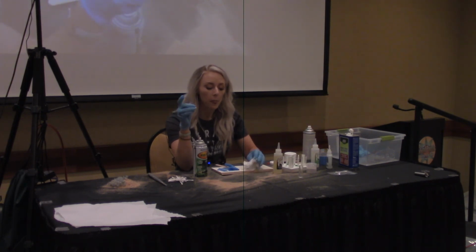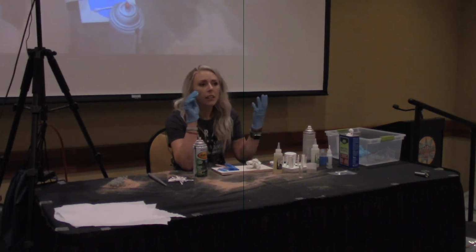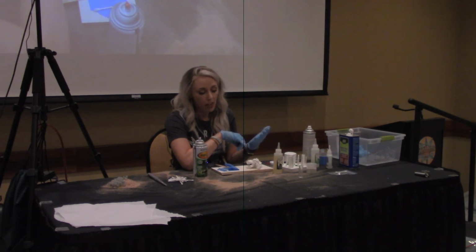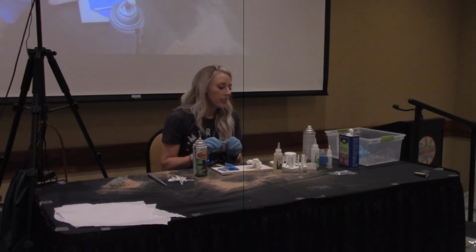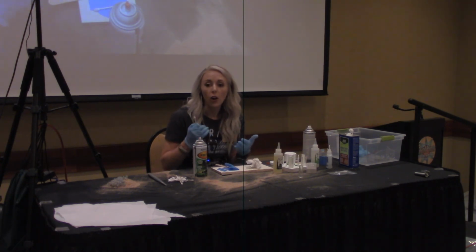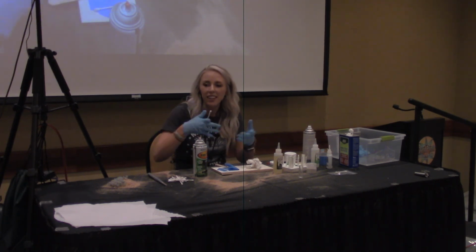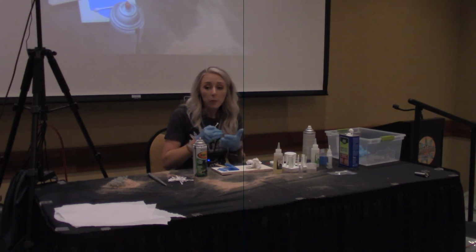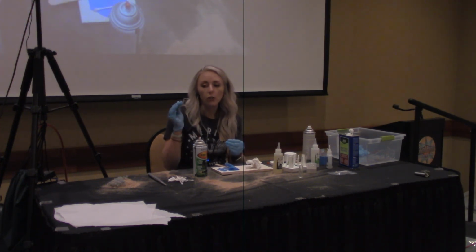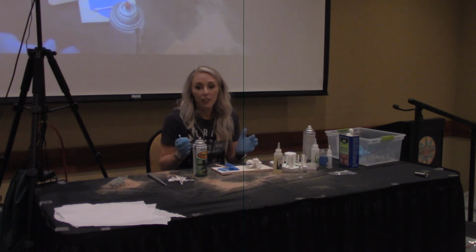Okay, so as far as any hybrid, whether it's my blank with flowers and wood, or something that has glitter, or something that's just colored resin and wood, I find that the best finish is CA. There is a bit of a learning curve on how I finish my pens with CA, because as you turn them, they are going to have voids, because the resin can't penetrate inside the middle of some of the flowers. It's impossible. On my website, I have a link to a video on exactly how I fill in the voids, the techniques that I use, and how to do a complete CA finish within 10 minutes, even on one of my blanks.